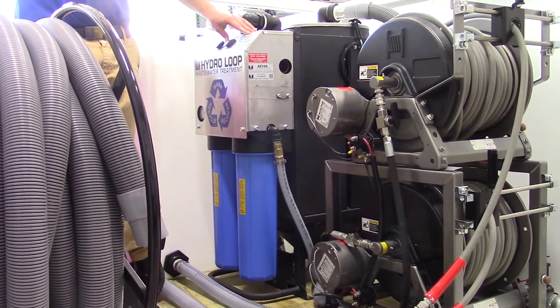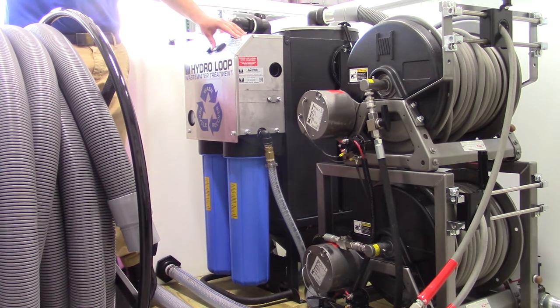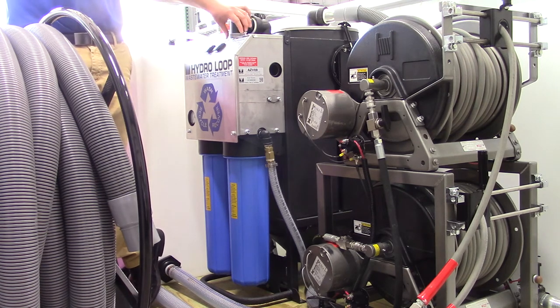Once it free-flowed, all of a sudden it works. You had to drain off the sediment tank — clean it up a bit. There's also a breaker, so if you do max out — say you neglected that tank and had enough slurry and sludge get into it — and you plugged your 50-micron filter, you'll normally see on the pressure gauge that it's higher than normal.